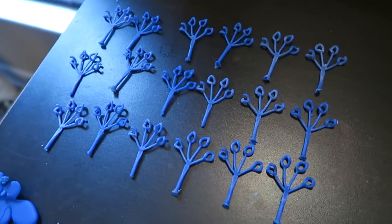Injecting just one rubber at a time takes forever. It's taken me close to 35, 40 minutes, literally, to inject that many waxes. Admittedly, I only needed to inject 15 of these little trees. I did 18. Why did I do 18? It was because in case that when I put them onto the trunk, the sprue, when I put them together, in case one or two really mess up and perhaps I melt them or they'll snap. So it's quicker and easier to do it now whilst I got the injecting machine hot and ready, as opposed to being just a little bit too short when it comes to sprueing them up and I have to put the machine on. Oh, well, you get what I mean.